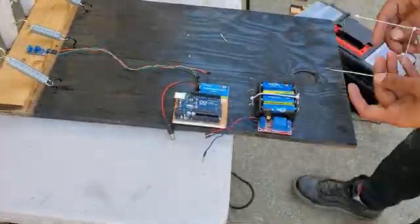Once the sensor is triggered, it'll flash for 10 seconds and then reset. I found that this sensor is very finicky — there's a little screw on top which you can adjust for sensitivity. You've got to get it right, otherwise once it turns on it can have trouble turning off. I've also found that it works well when secured down by velcro, as the velcro absorbs some of the shock and helps the little ball inside the sensor reset.